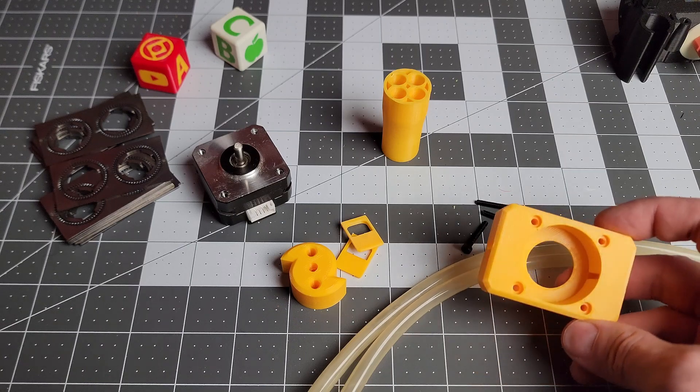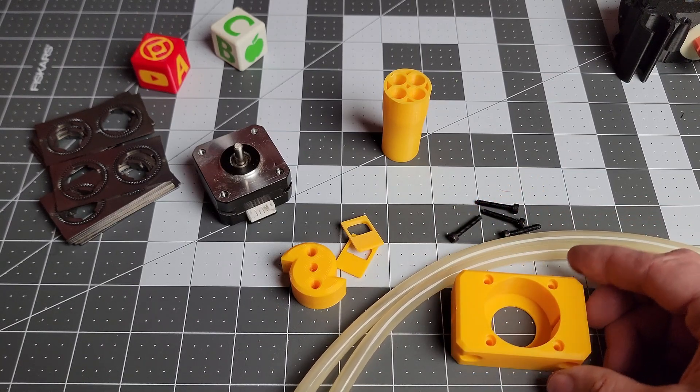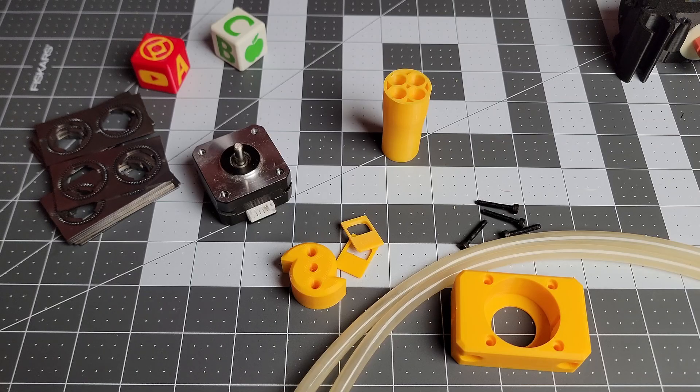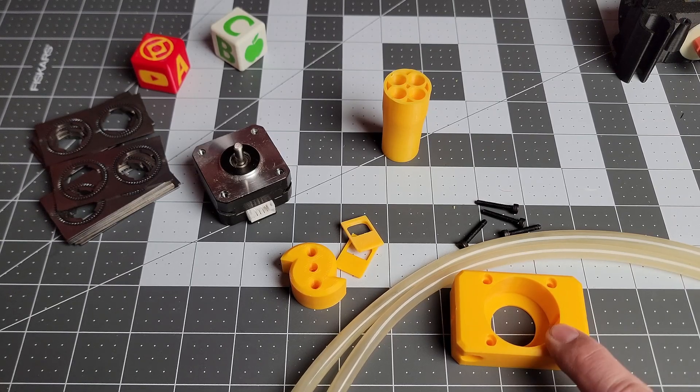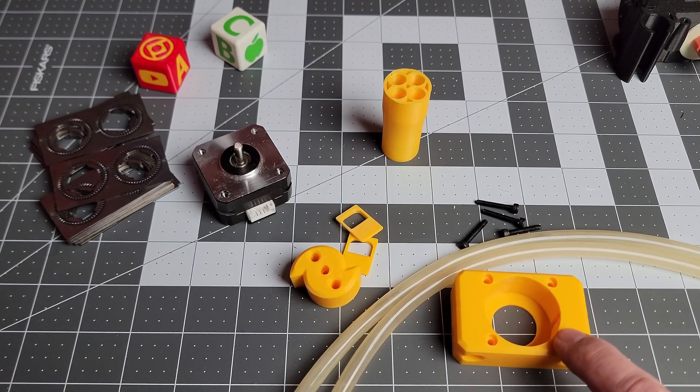So why this pinch valve? This pinch valve allows me to use one CPAP blower for two tool heads, to cover both part cooling and hotend cooling. The two part cooling tubes for T0 and T1 are modulated by this valve, while the other two tubes that go to the hotend and stepper motor are not modulated.